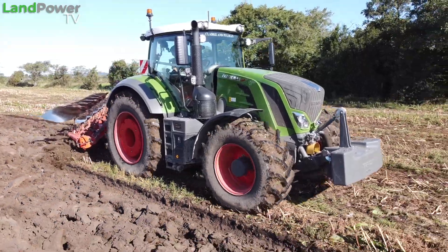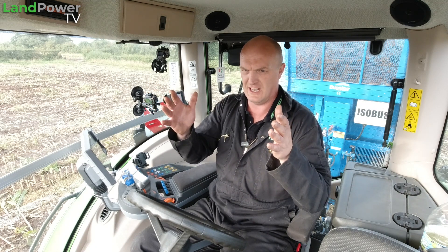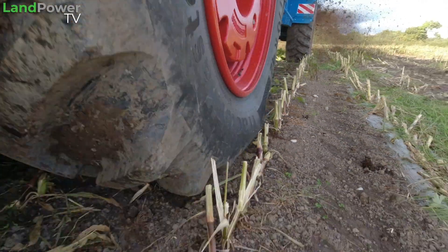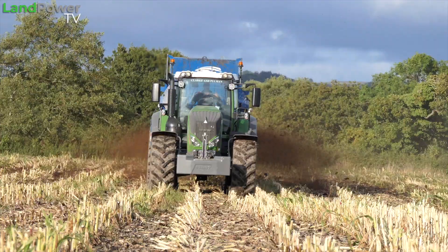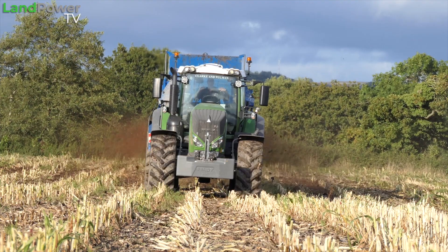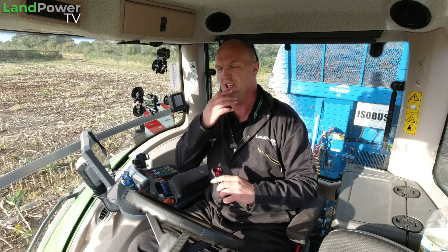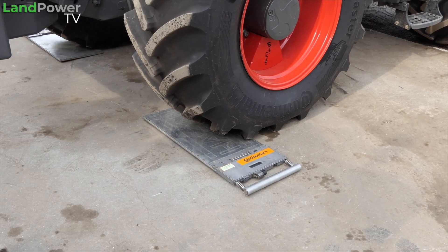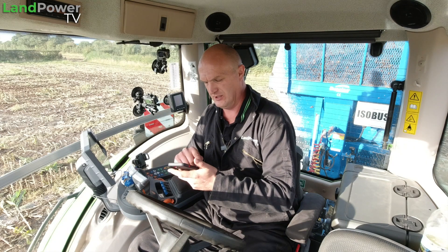Granted this field will be ploughed up shortly, so in terms of soil protection I'm not too fussed about the shallow to medium depth of the soil - it's the deep soil profile that we want to protect, because that won't be touched by the plough. So we want the tyres soft enough so they are spreading the weight before it gets too deep in the soil. Also, for productivity I want a good amount of traction, which will naturally come as we lower the tyre pressures. So we need to weigh the tractor - its front axle and rear axle - so we know where we're at.